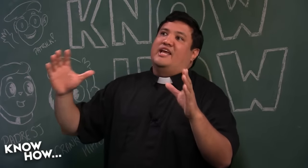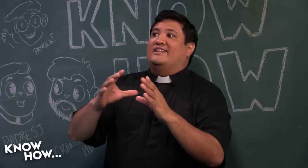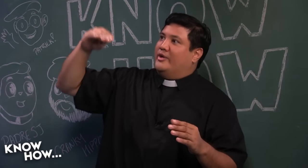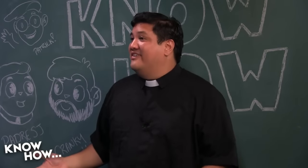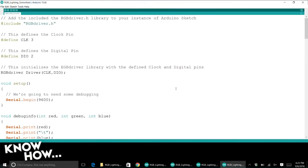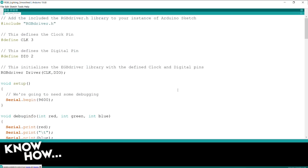So I'd say like take 10, 20, 30 values, take the average of it, and then we get something that's not going to fluctuate up and down quite as much. Where if there's a big change, it's not going to affect the numbers that much. Precisely. And oddly enough, I actually wrote that already. Oh. I know. Go figure, right? So if you go back to my screen, so this is the smooth version of the RGB driver.